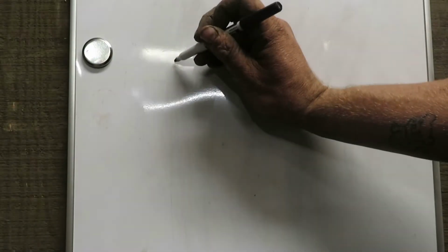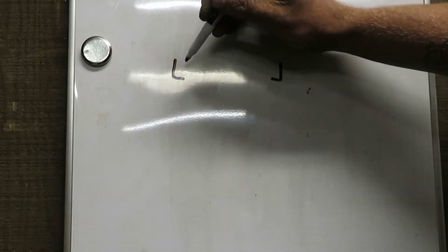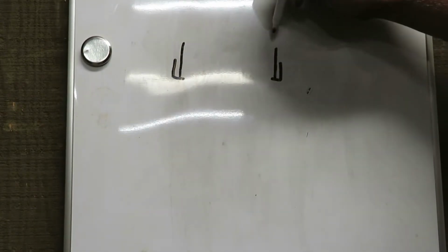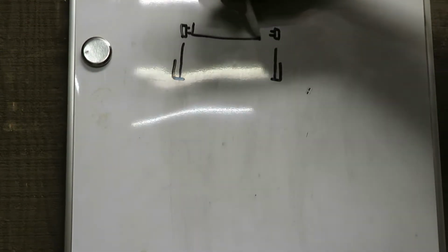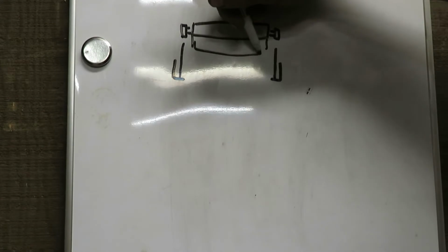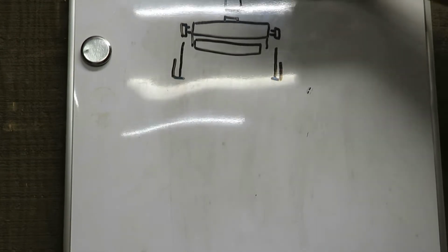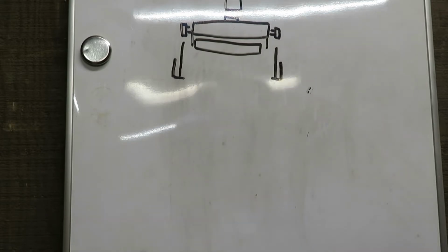All right, so we got the bottom piece intact. Let's just leave the rollers out of this drawing. For the top piece, we're gonna have two linear rails on either side sticking out of the bent part on those bottom brackets, on which we'll have some linear bearings riding. And that will have a bracket, probably on a piece of angle iron, that will come down and encase the top roller, and up top have a little receiver for the press bit. So, pretty simple. Let's do it.